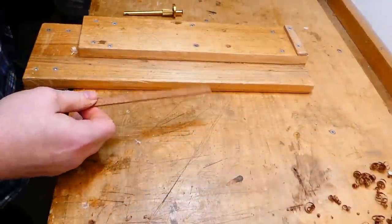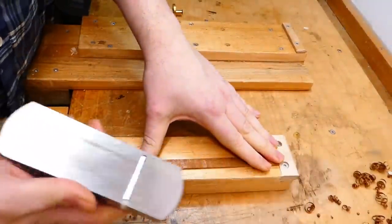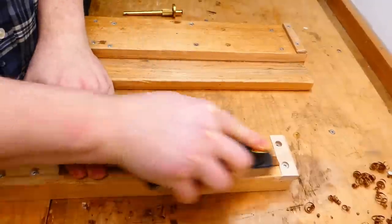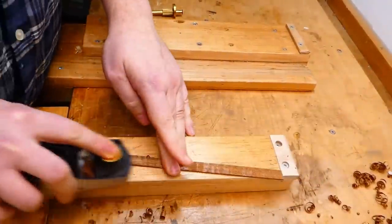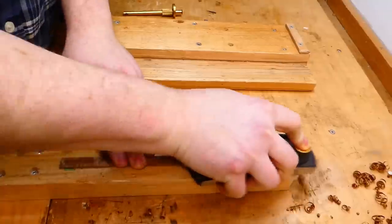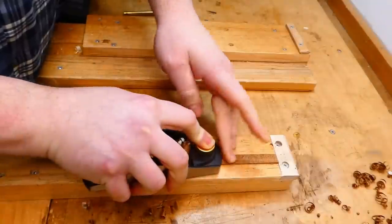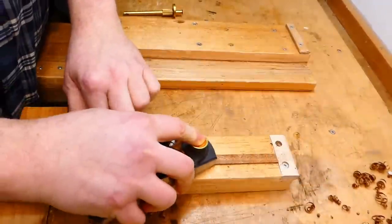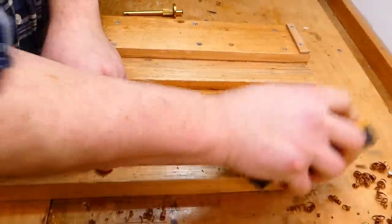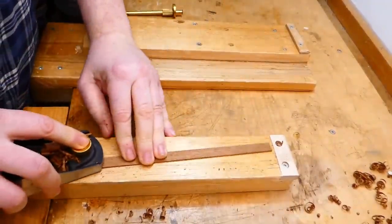What's the purpose of a cleat? The idea is that it'll help prevent a crack from opening up again. Whether it actually does that is sort of a matter of conjecture and very difficult to prove. Conventional wisdom is that a properly glued crack is at least as strong as the wood that surrounds it — maybe even more.